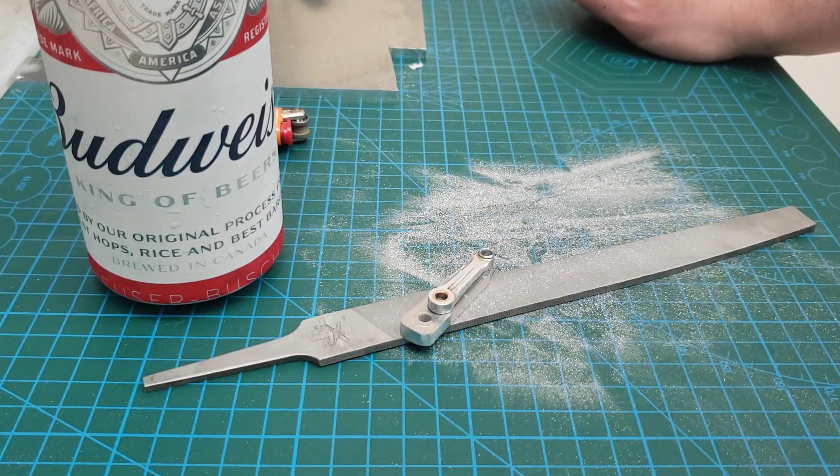If you put one of those in a 3.3, it will tune better, perform better, and be more stable. A lot of people say the 3.3 is a shitty tuning engine — I kind of agree, they don't hold a tune as well as a lot of other engines, even cheaper ones. An SH18 for example — those things hold a tune like a Swiss watch, they're a pretty good motor for their price. But the 3.3 with a decent set of bearings, replacing the rod, pin, a decent carb, plug, and fuel — they actually run pretty good and can last quite a while with proper maintenance.